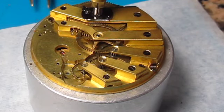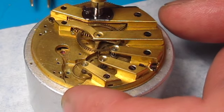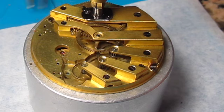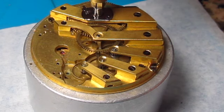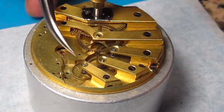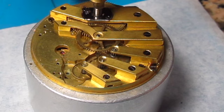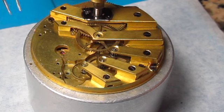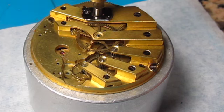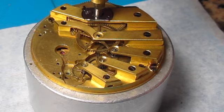This is the Tobias copper face. We've got all the gears in train and tightened down. Right there is that escapement wheel escaping — no chatter in the gear train. Looks good. I'll put in the pallet fork, which will keep any of this from turning until the balance is in. Let me glove up and do that.